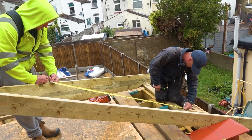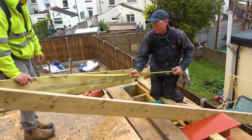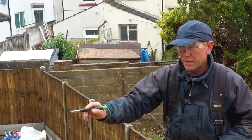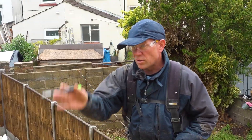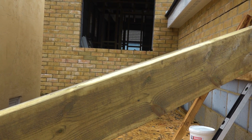I've got about 16 to 18. So that jack rafter is going to be 22 degrees on the plumb cut, same as that roof, and then it'll be 38 on the splay cut.